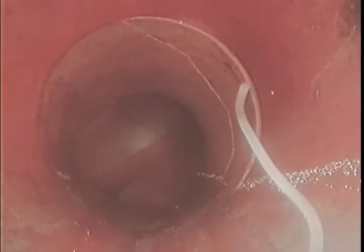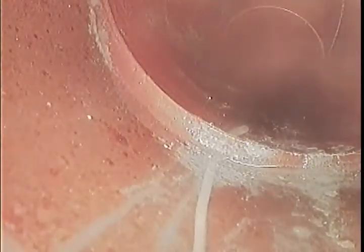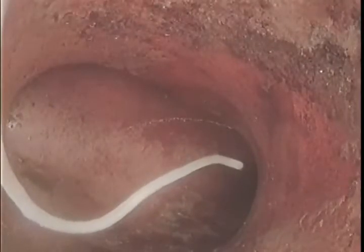As you can see, we've got a crack in the first joint, the connection to the main there. That's the council main there, which we've marked through the property as well. Coming around a bend there, it's 100mm earthenware, we've got a slight negative displacement there. This is the junction that takes the kitchen gully trap and the wastewater out of the garage, which we're going to film straight after this.